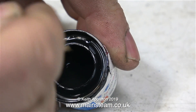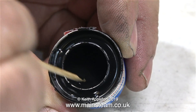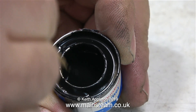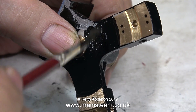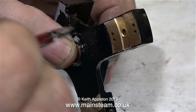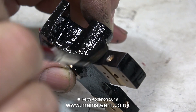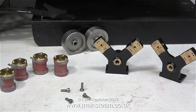And now, with mounting excitement, it's time to paint the engine. What colour should I paint it? The engine is called a Black Gates Twin — I think the colour is possibly in the name. So black it is. This is a tin of Humbrol Satin Black paint, the same tin I used to paint the horizontal Southworth engine's water pump, and as that looks good I'm assuming this one will come out the same way. Because of the porosity of the castings, I may need to give it two coats. I'm confident the black paint will stick because I used Phoenix Precision Paint's single package primer first. I need to leave the cylinders for a while to make sure the cellulose putty is fully hardened before painting those.